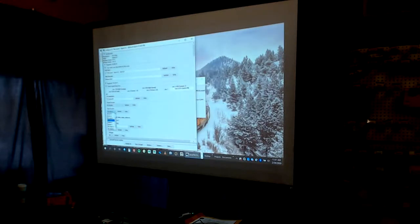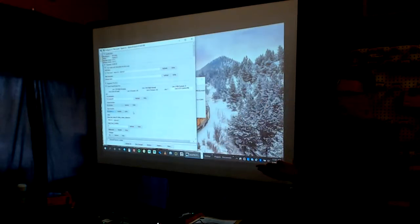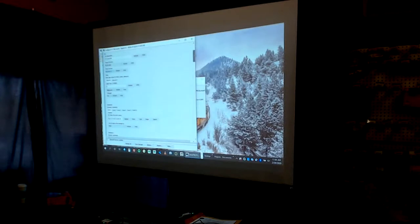Check this out. So I could make it active high and active low, but this one is alternate action low. In other words, what I'm actually doing, check this out. Every time I push this button, it's sending a command first, set it to normal, push it again, set it to reverse. It's actually sending out two commands with the same push button. It alternates back and forth every time. And it's with one click. I didn't have to write the logic for that or anything else. Now, if I had two push buttons, I could say normal and another one named reverse. But I'm calling this one alternating action, so I just, with one push button, can do two functions on it. Okay, stuff excites me. We can tell.